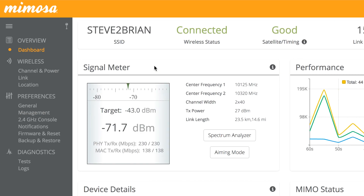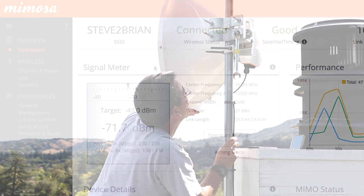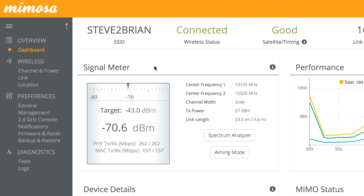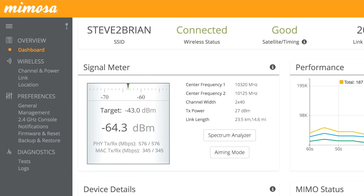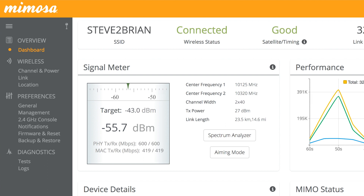We're currently at NEG 71.7, so we did pretty good with the initial mounting and alignment via the compass. Now we're going to start fine tuning the dish. We're going to start moving left, going horizontal. NEG 70.6 is what I currently have — now it says NEG 73.2. Let's move back to the right to hone it in. I see NEG 64.3, 60.1 — now I'm at NEG 55.7.